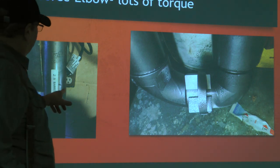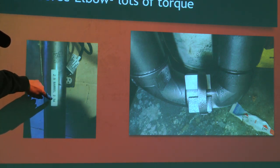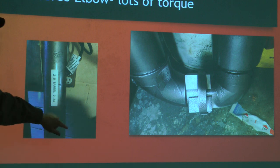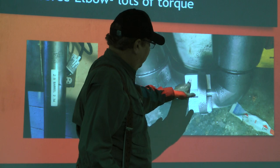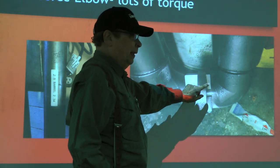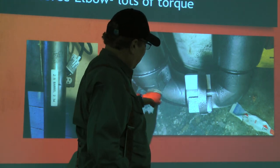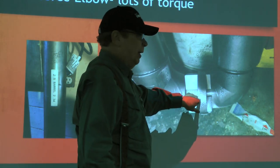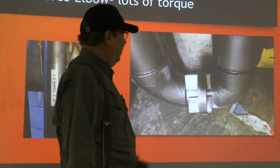Here's a close-up. We have a two-and-a-half inch nominal barrel — it's 2.34 inches ID. I made a couple of pieces of aluminum angle clamped around the joint where the two elbows meet, to reduce any stress on that weak point.